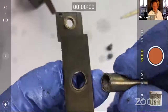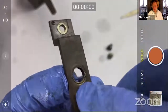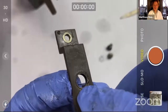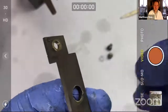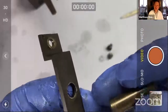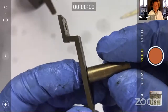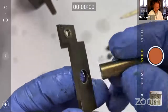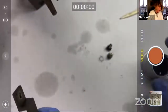Because it's very thin, because what they've done, the maker, quite rightly, is they've got the graver in here to clear out this corner to make sure that the dirt or swarf or whatever can't get in there between the back of the hour wheel pipe. So to make the bearing work really well, but that has left it quite weak and it snapped off when the clock has been dropped or something. So the question is, is it going to be straight if we just solder it back on?